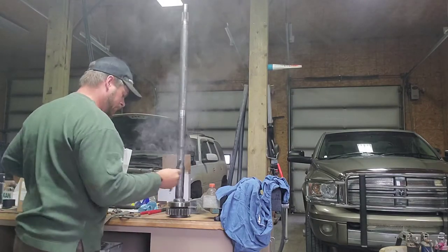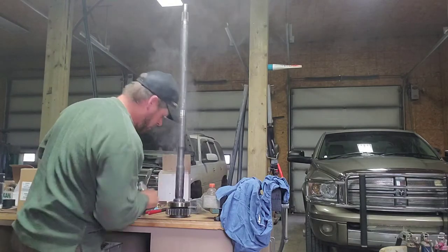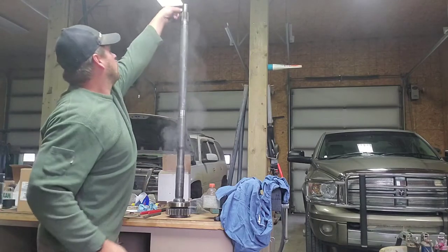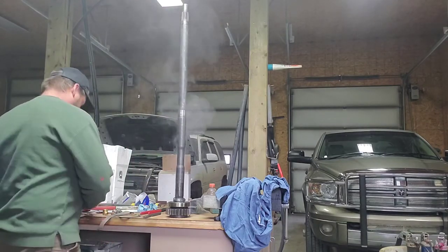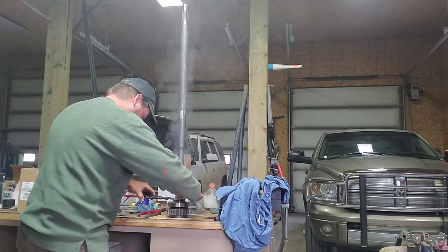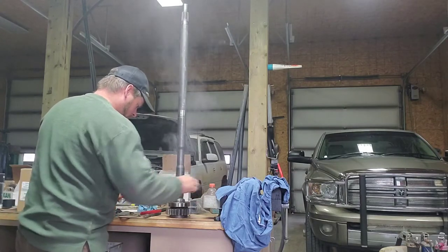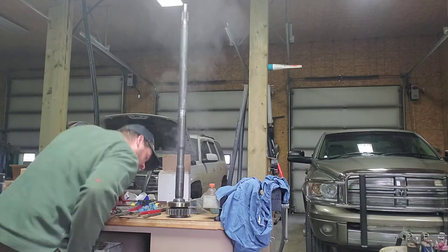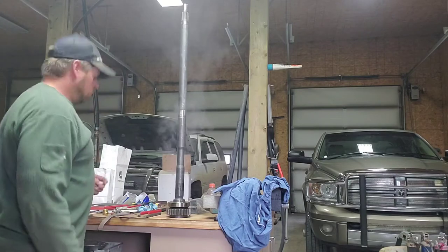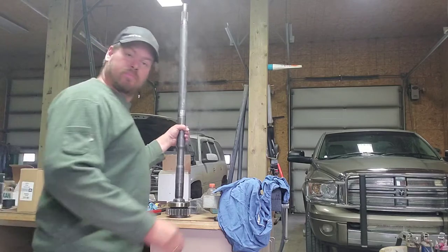That should be, it's on. Now this is a pressed bearing. Just make sure it's sealed. And then we got a snap ring that goes on there. Now this bearing, along with another one here, they have to be seated. It's nicely seated. It will cool down fast enough. So one down, one more to go.